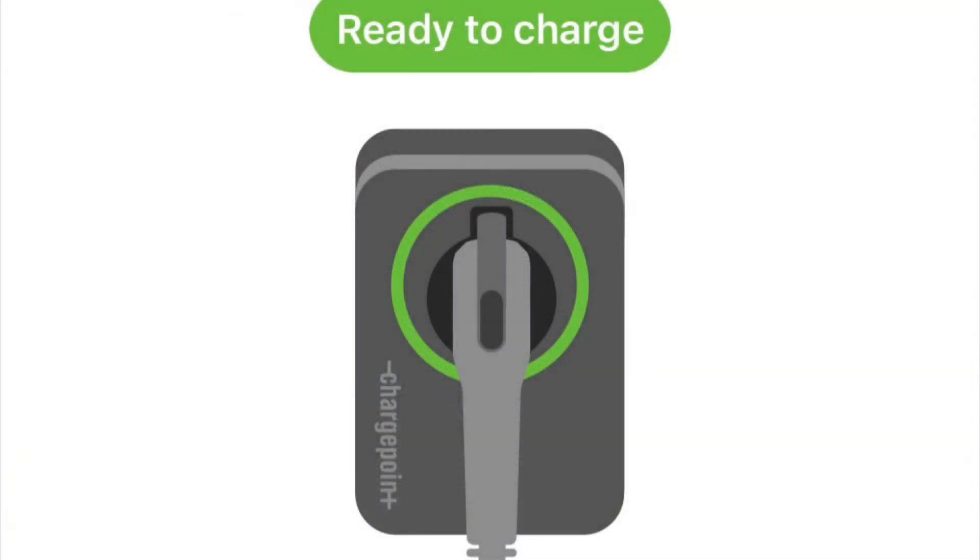Install the covers and turn on the circuit breaker. Then open the ChargePoint app. It'll pair to the charger with Bluetooth and ask for your SSID and password for your WiFi. Then you'll configure the charger with some settings including the maximum charge rate. It'll ask you for the circuit breaker size and then determine the charge rate from that.